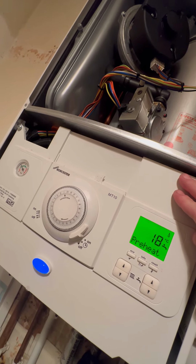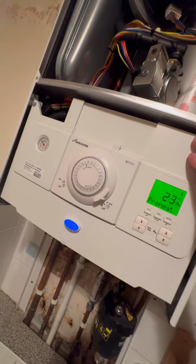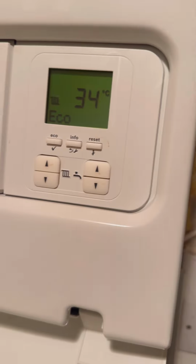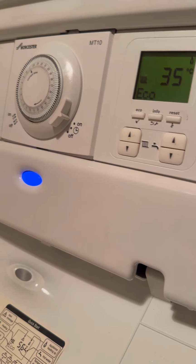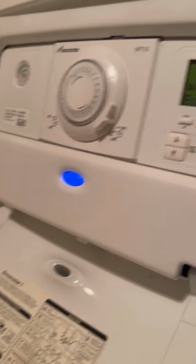Green light means go. You see the little flame symbol lit. That's the hot water check. Now I'm going to check the heat in. It's always good to check both. Can hear it click in. Radiator symbol shows it's picked up the heat in demand. Blue light's on. Yeah, it's fine, thank you. Flame symbol's there. Radiator's getting warm. That's another one done. Happy days.